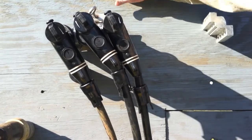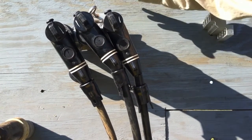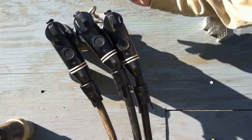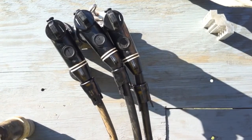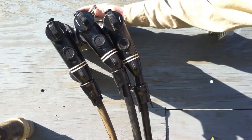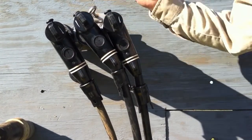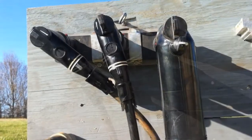If this transformer goes out with this method, locks out, burns up, and you're feeding in and feeding out to one more transformer at your business, at that point you're going to lose that other transformer. With this method, you just isolate your old transformer that's bad, and you can still run off your other transformer.